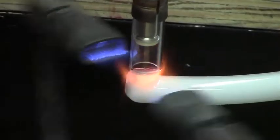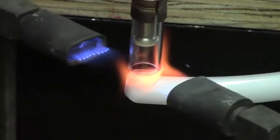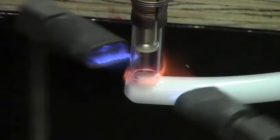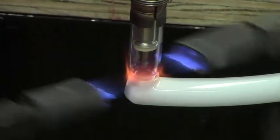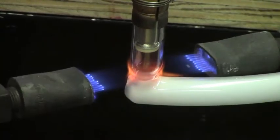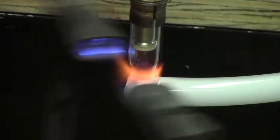When you're ready, you can stick the electrode. Probably the most important part is you have to keep the heat on, letting the glass meld together well. The line between the tube and the electrode should disappear completely with enough heat and patience.